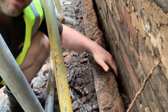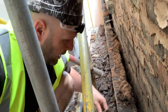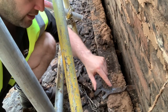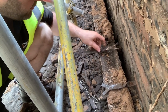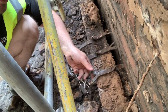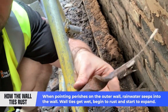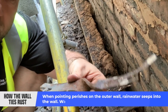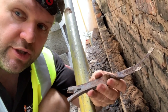Can you see this gap? This house has been set out with a cavity wall, which is unusual for these houses. What would happen is these brick ties would go in here and into there, tying one layer of brick to the next — the little twist goes in the hole. What happens then is when the pointing goes on the outside and rain gets at these things, they start rusting and splitting, and what it's done is actually lifted the entire wall up because the rust has expanded the joint, which has expanded the brickwork and pushed it all up.